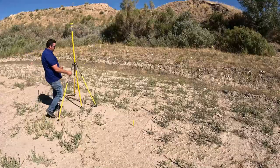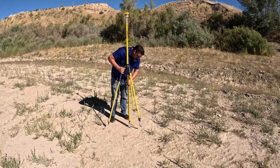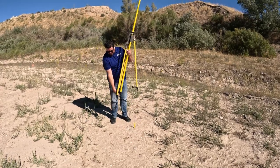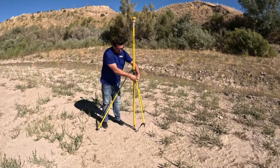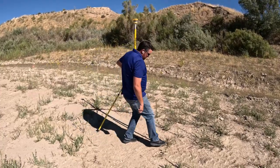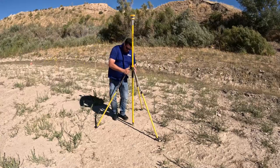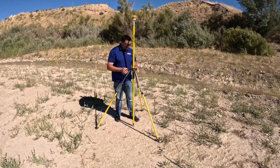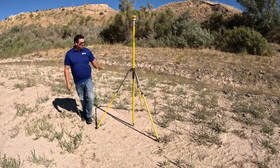This pole right here is a two meter pole, but with that extension and to the middle of that target where the total station is going to reflect off, this is a seven foot pole at that point. The setup is pretty traditional, just like any other pole setup. This one being three legs is nice because it'll allow you to make sure it's not going to blow over when you're not around it. Always check the points on the bottom — this one's just a hair loose. Kick out the two legs and kick those in. This one has a set screw on it, so I always loosen that, slide it out to where it's positioned, leave that loose, kick the foot in, then make sure it's tight. On the bubble right here, just go ahead and level that up. It is important to check the bubbles on these because they can get off. Once that's level, go ahead and tighten this up.